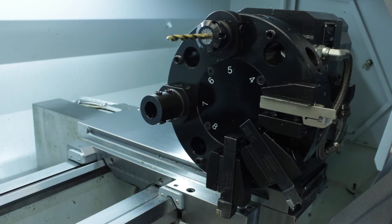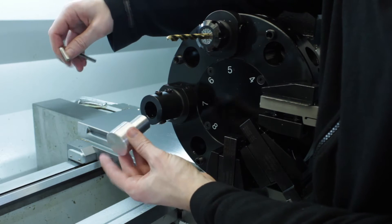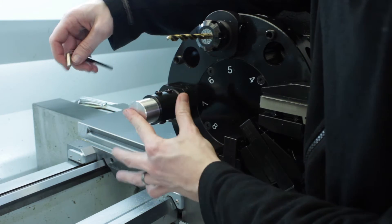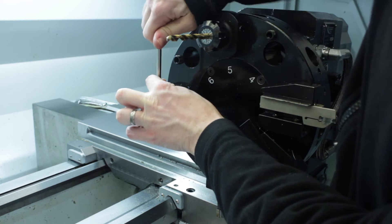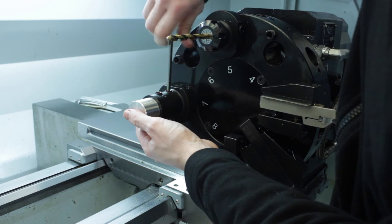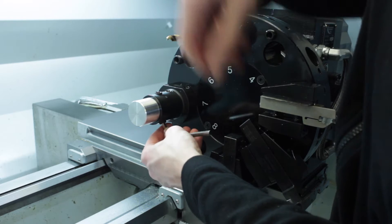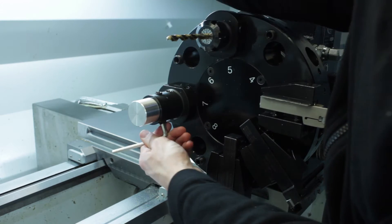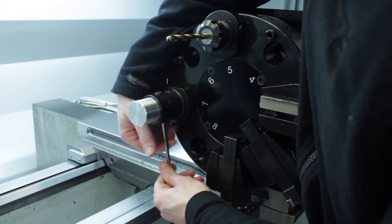So this week we're going to show you what we've come up with. That solution is a manual bar stop - just turn this little piece of aluminium up which fits in a boring bar holder. Now what I need to do before I run the program is just manually set the tool offset so that when this is at X0, Z0 it's exactly the right place to start the program. So I'll get this installed, run the program and then hopefully you should see what I mean.